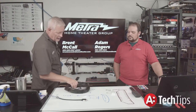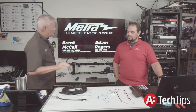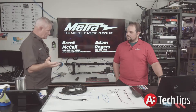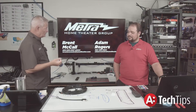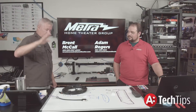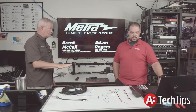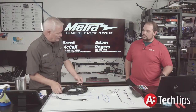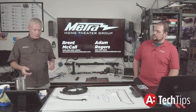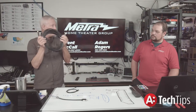When we spec fiber cables, we expect a one-amp power supply. As I am learning more and more about new TV situations, I'm recommending a two-amp power supply, because overhead is great — it's not going to draw enough to damage it, but if you need that additional current, because you're not just powering the fiber itself — when you look at the new fibers, the first version was powered at both ends, so each one got a power supply, but now they're powered at one side.